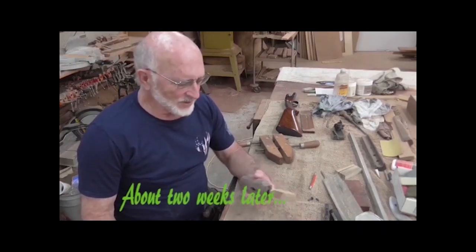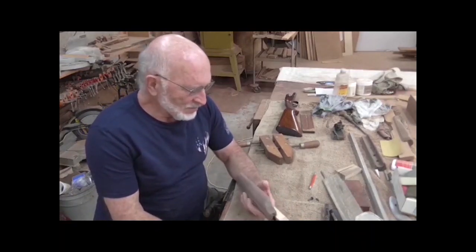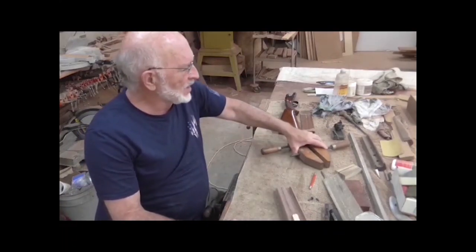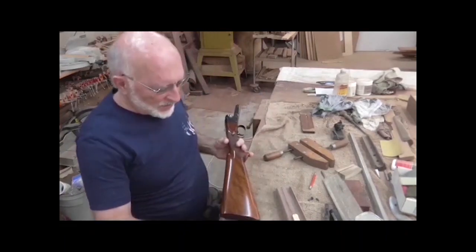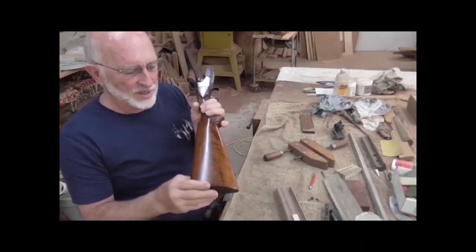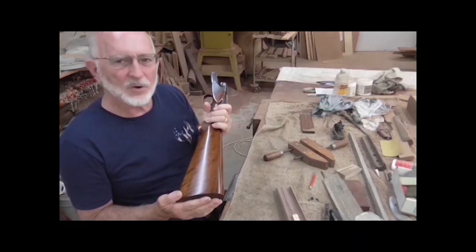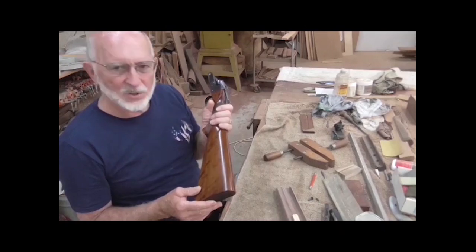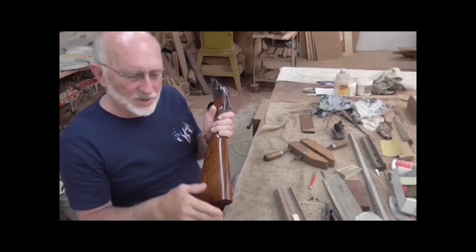It's been kind of an ordeal trying to get this color matched. I haven't run the serial numbers on this shotgun, but I'm going to say it's from the 50s or 60s, maybe late 50s. And the finish that they used basically was a varnish finish back then. And this stuff has yellowed with age, very gracefully, very beautifully, but it is yellow. Oil-based varnish turns kind of amber with a lot of age. And so to strip this and refinish it in a more modern look would take away from the value, so that's really not an option.